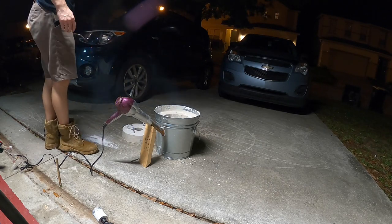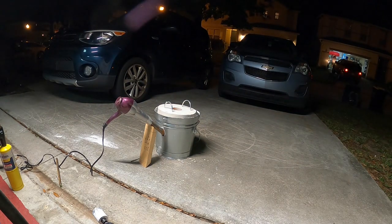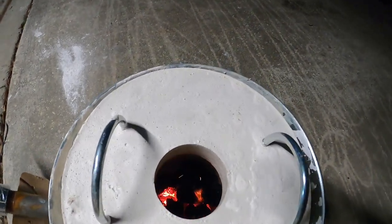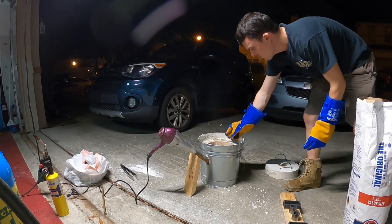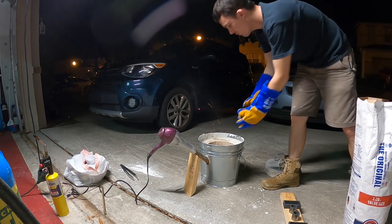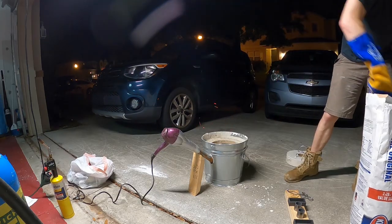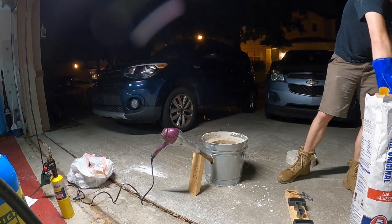The hair dryer works perfectly for getting enough oxygen to the coals. If you're using a used hair dryer, one tip is to make sure you empty the filter on the back to increase the air flow. One downside to a charcoal furnace is that you have to constantly add more charcoal throughout the melting process. Using tongs was the easiest and most accurate way to add charcoal without accidentally dropping it into the crucible.